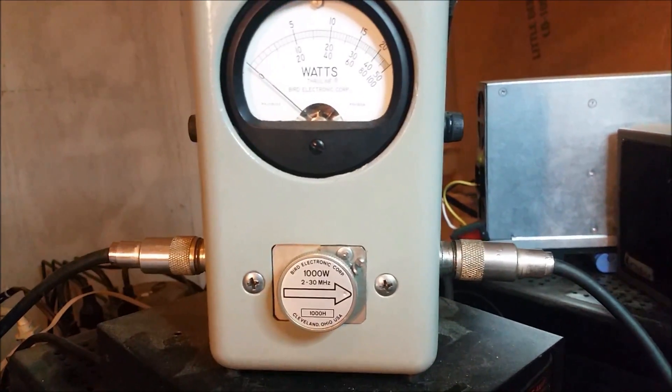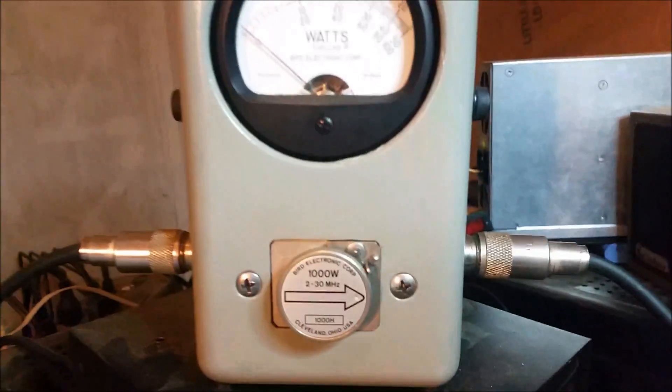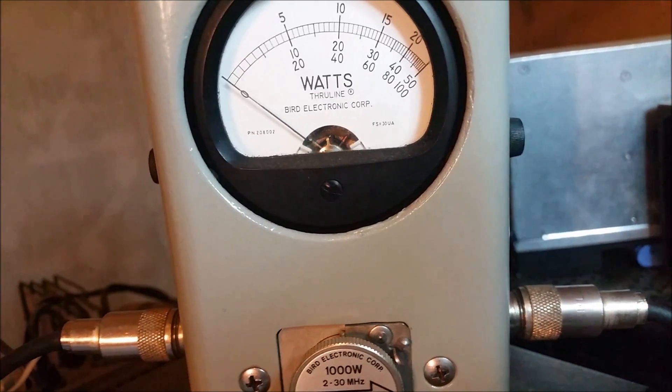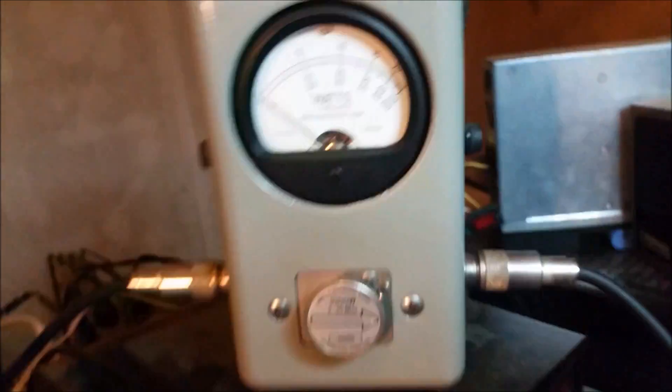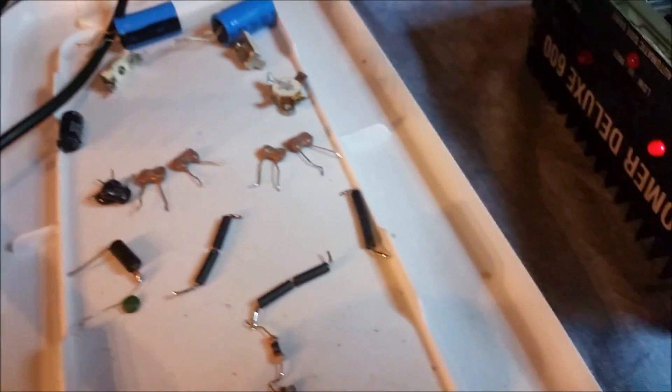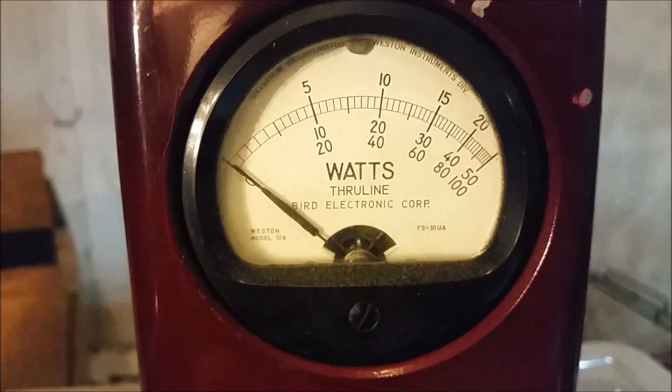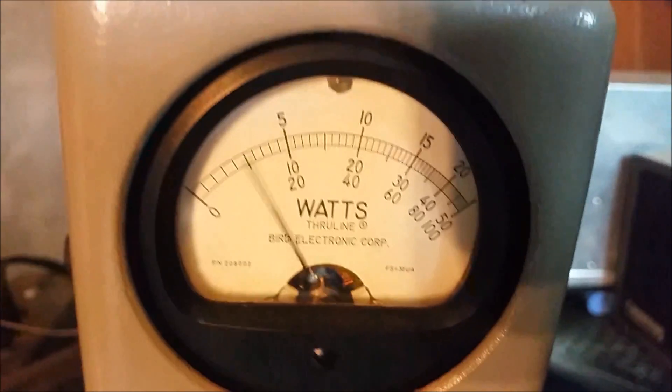We'll get it on that supply over there. I'm not sure if it'll hold it — it did cut off when I hooked the hot radio up — but we'll roll on that first, then hook it up to the unregulated and give it what it really wants current-wise. Here's your thousand-watt slug — this is your RMS. Oh yeah — we've got about 160-170 RMS. I'm about to unplug this so I can show you the input reflect. Like I said, it had a watt of input reflect before I tuned it. Here's the input reflect now — 100 times better.